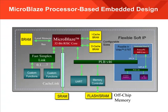This diagram also shows a pretty typical application that uses not only a MicroBlaze processor, but also a 440 processor. In this case, the PowerPC 440 system has its own PLB master bus and also has a shared slave bus that is also connected to a MicroBlaze core. This is done so that the less time-intensive functions can be offloaded to a separate processor. In this example, that might be the MicroBlaze processor. Now don't forget, MicroBlaze again is a soft processor core, which means it uses standard FPGA logic, thus it can target any of our FPGAs.